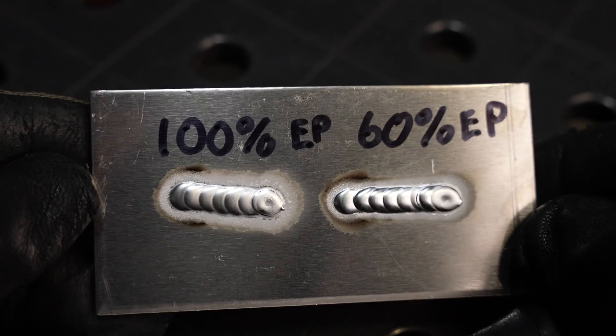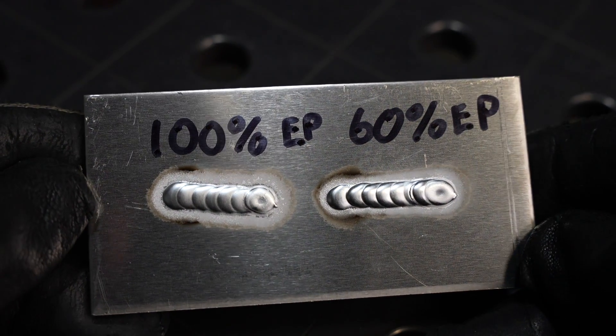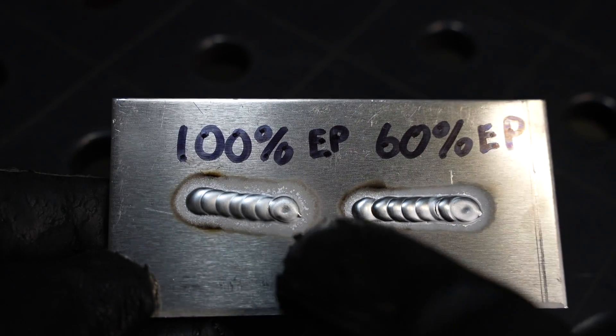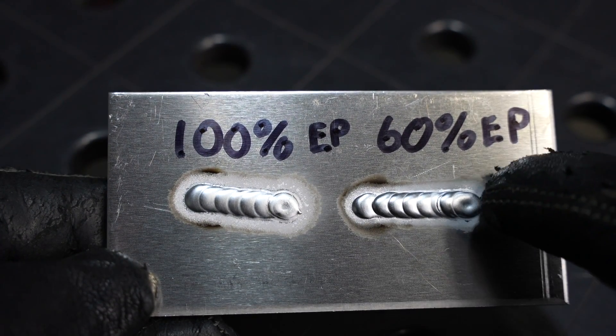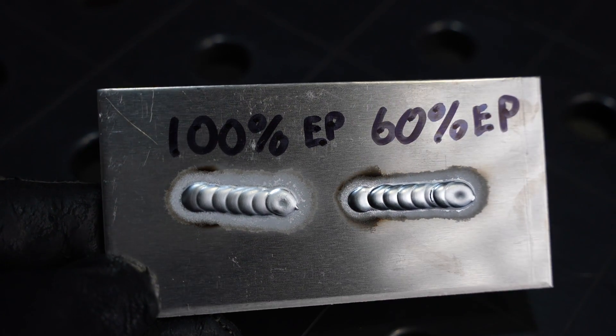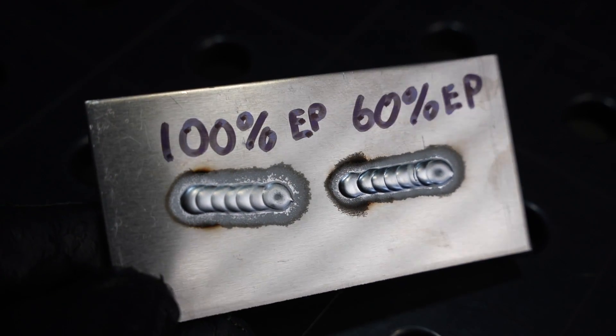Now I'm going to change only the electrode positive and reduce it a little bit. What you'll notice is that the frost line is tighter in front and tighter to the sides, and it also helps keep the tungsten electrode sharp because it puts a little less heat back into the torch. You can see that narrower etching band. There are other ways to control this — using a smaller cup, modifying AC balance — but you can see the effect it can have.